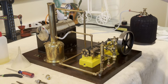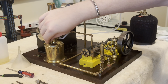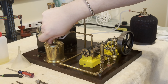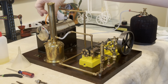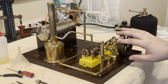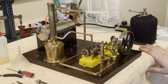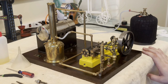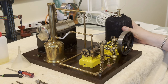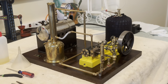I'll put the screw back onto the condenser and close my valves. If I wasn't going to run this again for a week or more, I would completely oil everything externally so it doesn't rust. But I'll probably run it again in the next couple of days. Make sure your gas is off at all times — you don't want any residual gas. Put the safety valve back on, but don't screw it down because the boiler's hot and it'll create a vacuum, making the valve hard to remove next time.